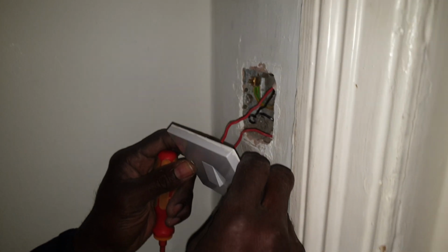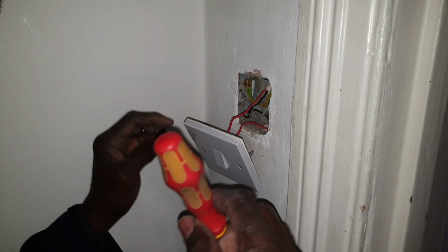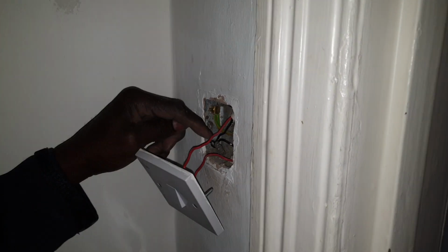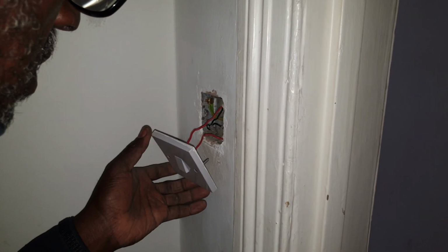There are 2 cables. That's a live and a neutral. Yep, switch line, live and neutral, and the neutral is connected to continue, so that's all good. If this is the live coming from the fuse board, then these 2 lights are going to go out. Right, okay. Doesn't go out. So what the hell is this? So that stays on.